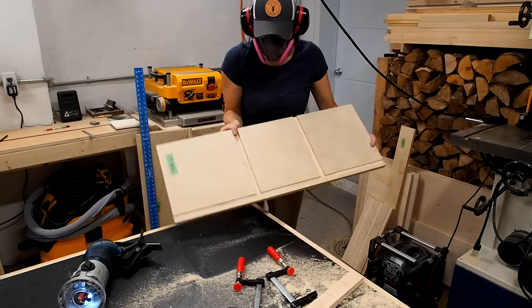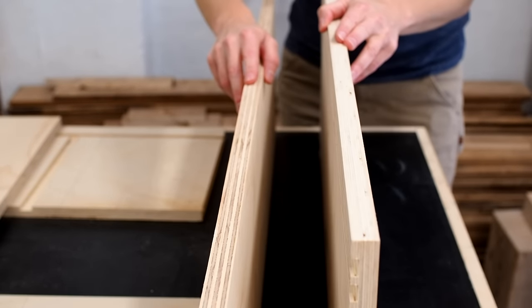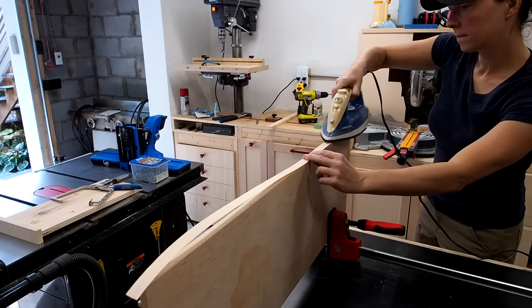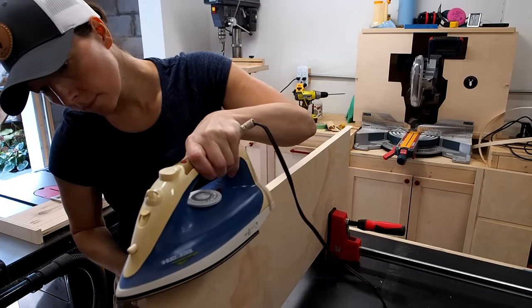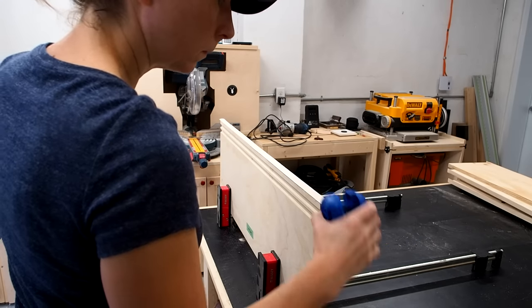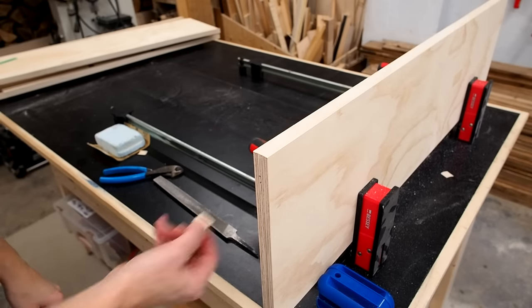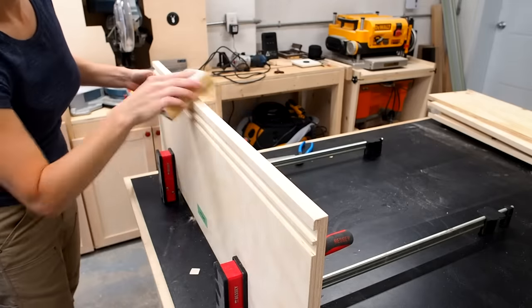With that done I could move on to assembly, but I noticed that my plywood edges are all different in pattern and color, so I decided to add some quick iron-on edge banding to hide the front edges of the cabinet. This is super easy to apply using an old iron cranked up to the highest setting — just take it slow but keep the iron moving until the glue melts and sticks the banding on. After the piece has cooled off I like to use this edge trimmer to trim the sides — I'll leave a link to this tool in the description below. Just squeeze and pull along the edge and voila, then snap off the edge and clean it up with some sandpaper.